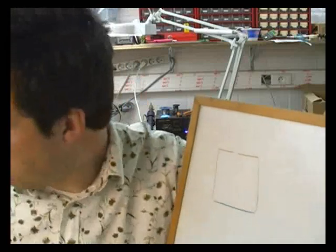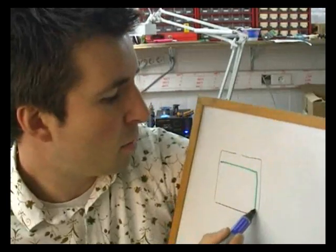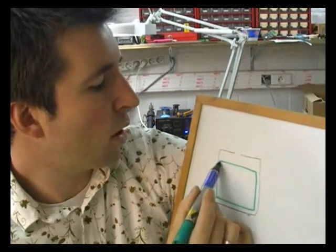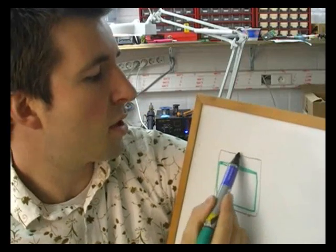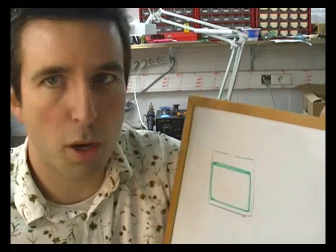You've got a fuel block, which is basically just a cylindrical block inside of the motor, which can only burn on this surface. So this surface area is well known. The size of the hole, the surface area there, is well known, so you can do the math and calculate it.